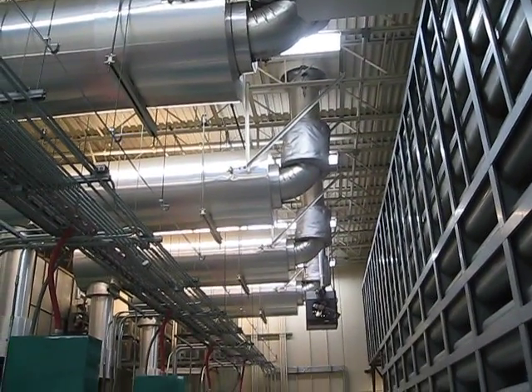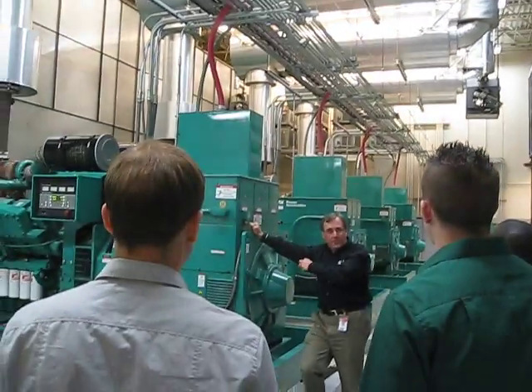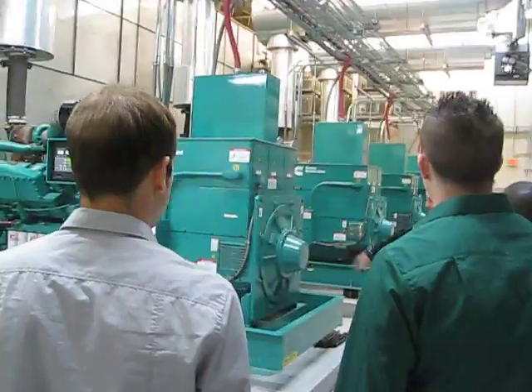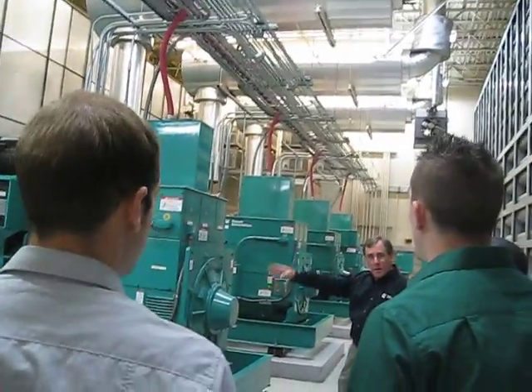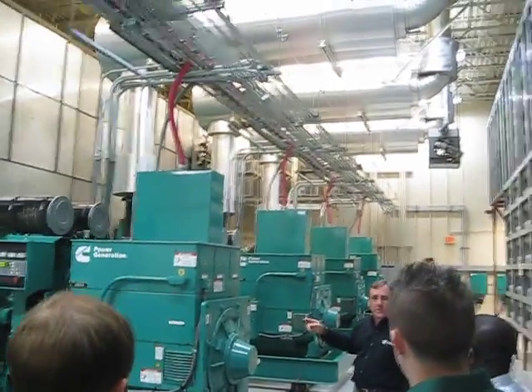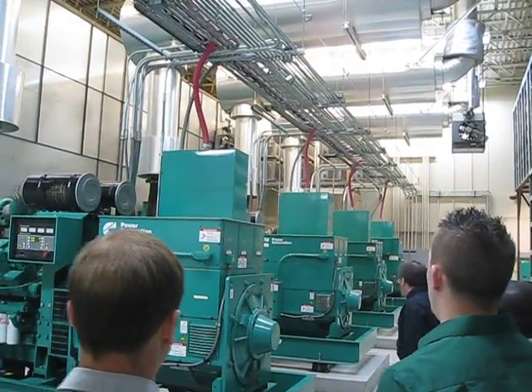We hold it about 60 degrees during the winter. After they're running, it doesn't matter — we pull the cold air through. But it knocked down the use of those block heaters. They cycle all the time, and they were cycling so much that I think in the first winter we replaced almost every block heater.